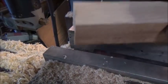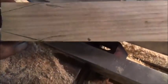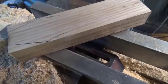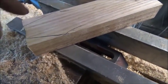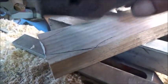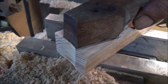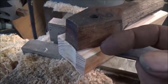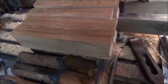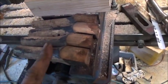It came out perfect, right on the line. Okay, so now we're going to set up for our 5 degrees. I'll probably hand-do everything on the round part, but the most important part now is going to be the two 5-degree angles on the end. This is the widest section — we turn it over and it's narrow. We'll put it marked out. I'm going to go ahead and end this video here and we'll get set back up and do the angles next time.